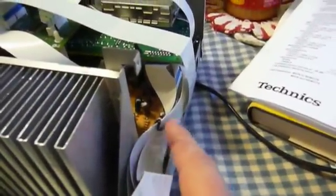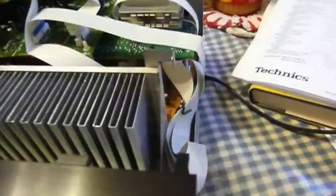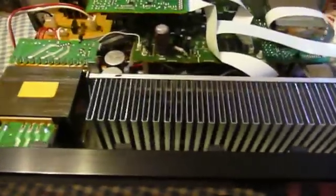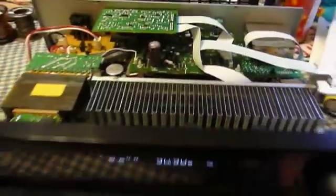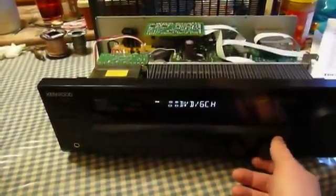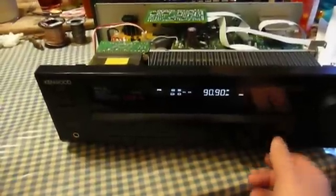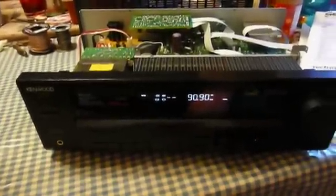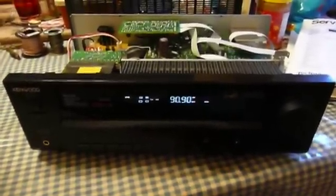I found some other bad solder in the unit. There's a little ground tape right here that holds these ribbon cables all together — I would assume that goes to a ground. But it's loose and I haven't fixed that yet because it looks like I'd have to take most all of the boards, the heat sink, and even desolder a couple things to get it out of there. Since it doesn't seem to be hurting anything and the unit seems to be working fine in every other way, I think I'm going to leave it alone. I'm really not a person with a whole lot of interest in home theater stuff, but this isn't a bad little introductory set, so maybe I'll try setting up a home theater in the living room.